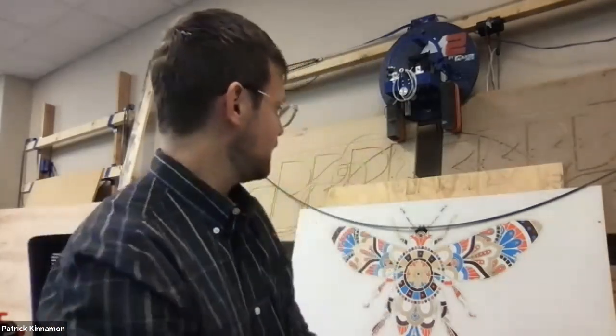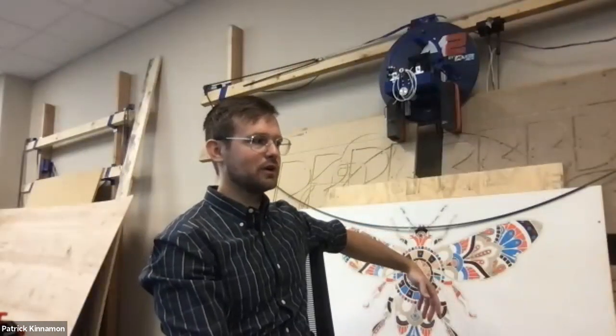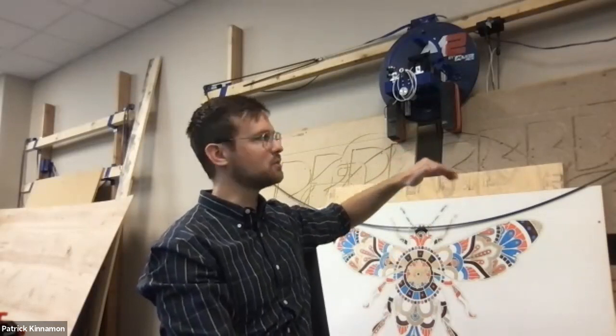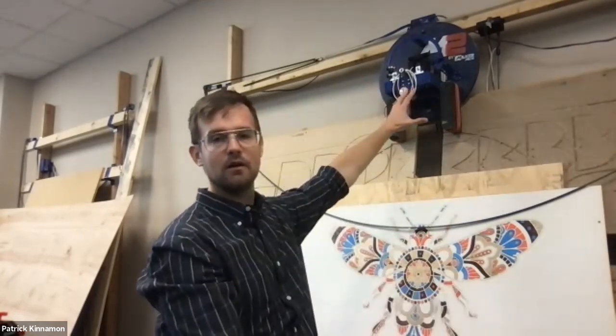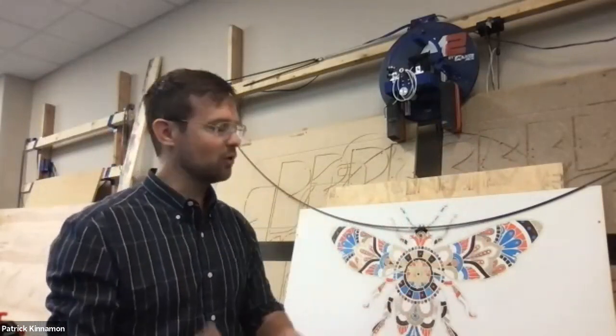Okay, good. Like I said, it's not always super critical. This measurement, top measurement, bottom measurement, I've found, at least in my experience, is not as critical. But if your top measurement isn't really close to spot on, you are more susceptible to some form of bowing of the motion between the ends and the center. If you're off by a little bit on the bottom, it's really not as bad. I think that's simply because when the machine is up here, the chains are essentially horizontal, so any amount of slop there causes an enormous amount of tension. Down here, it's just lax and really easy going, so it's not going to be as big of a deal. So you are kind of on that cusp where I would probably, to your point, go ahead and try to really get it honed in.